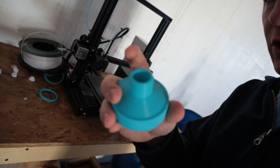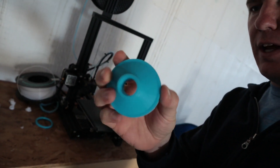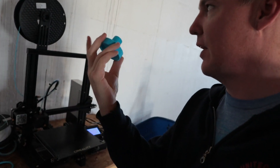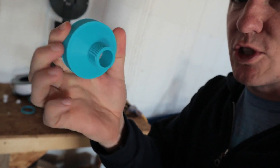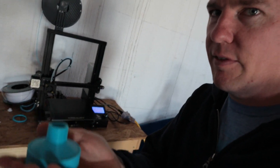The garden hose will hook to this part right here, and this part will thread onto the IBC tote. We'll see how durable this is — it's printed in PLA. ABS will be a little bit stronger but I don't have any ABS filament and I haven't printed with that yet, so I'll give this a try. It looks pretty good, I'm happy with the print — it seems solid and strong. I printed it at 100% infill, so it's pretty heavy, which is also why it took about six hours to print.